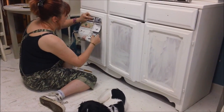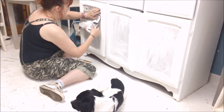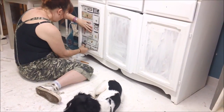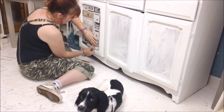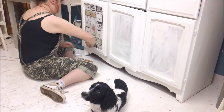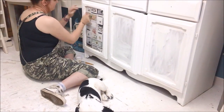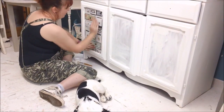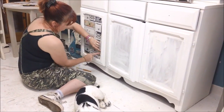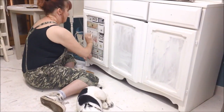So having put it on very, very thinly, I'm literally just going to press it in place. Because it's dry, it's not all going to bubble up too much, and you will get a few bubbles, but you have got room to reposition it, because that's the nature of PVA, and then smooth it out. As it soaks in the dry PVA that you've put on, you might get the odd bubble and you can squeeze it out, but don't be scraping it and trying to re-pull it, because it will settle back down once it's dried.